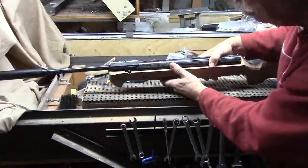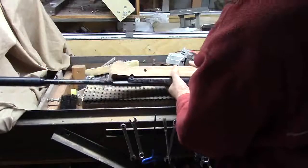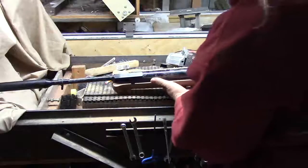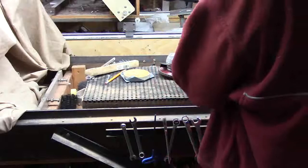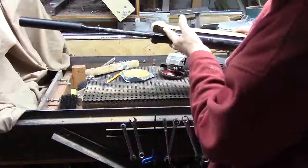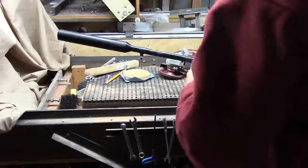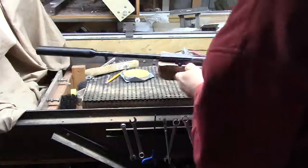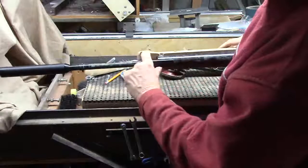So I'm just working it by hand and taking my time at it. That's no profitable way to do a project, but I assure you when it's done it will be perfect — it's just taken a while. I probably need to just use some horsepower to help speed it along. There's another little difference there I ought to adjust — a little more gap on this side than on this side, so I need to give this a little bit more of a gap. It's probably got a little bit of excess in the bolt hole — actually, this is a nice tight fit right here. I just need to open that up a little bit to match that.